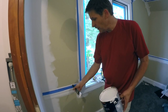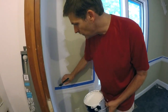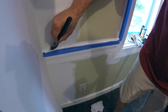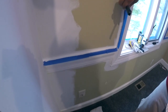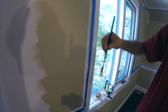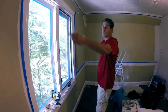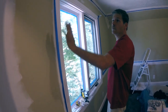Now, we've already got this painted and then we put our masking tape on there. But now what I do is go over the edge of that masking tape with the color of my trim, which in this case is white. What that's doing is it's going to help you create a real clean line. So before I do anything else, I just paint between the wall and that tape. And when we come down here with our color and peel it off, it's going to leave a nice straight clean line. Once you have done this and this dries — it'll take about an hour to dry — you're ready to put your wall color on.